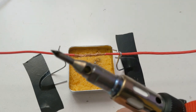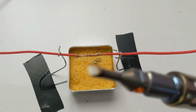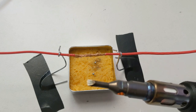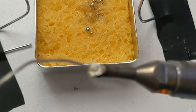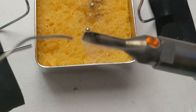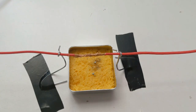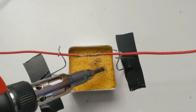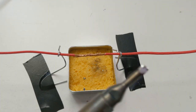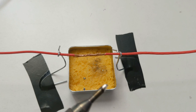You'll see how fast this heats up — it does much better than a lot of the irons I've seen in the past. You can see it already melts solder, very quick. Also be sure not to breathe the soldering fumes. We're going to go ahead and wipe the tip off on the wet sponge. You can see we've got a nice shiny surface — our tip is all nice and tinned. That's going to make for a nice clean solder joint and gets all the oxides off.